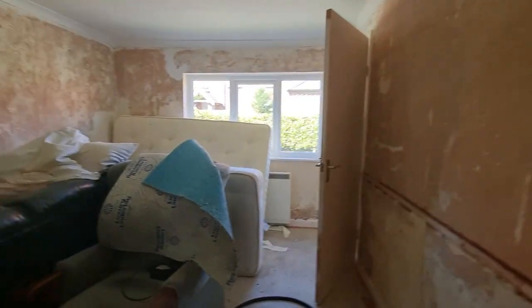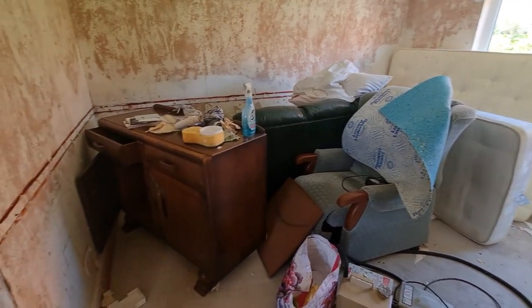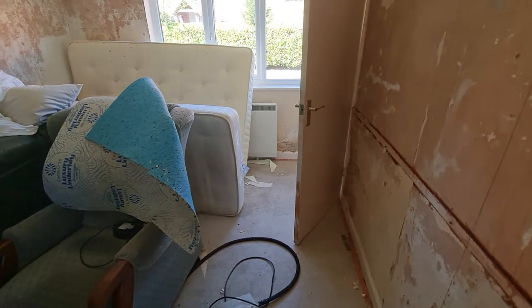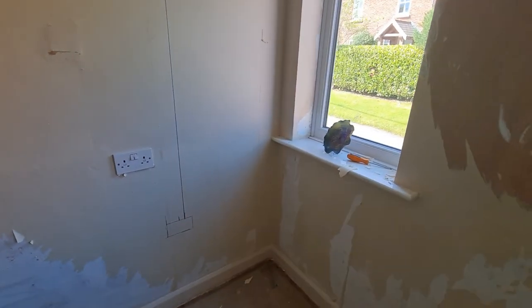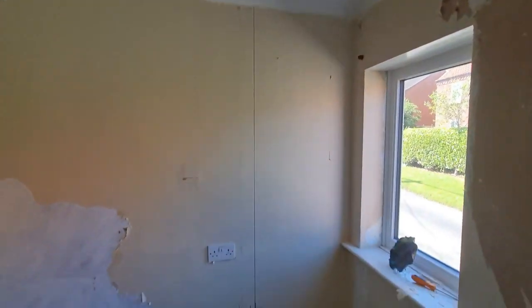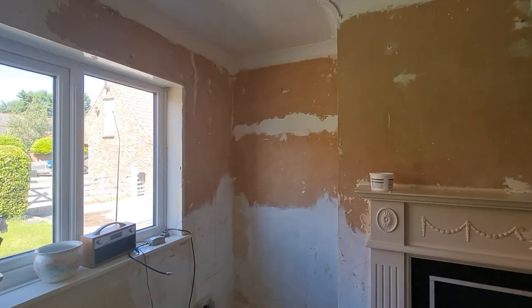Matthew's just done marking that up. This is the front room - there's quite a bit of furniture in here, all coming out before we start. There's actually a damp course treatment going on in this property, so the plaster is going to be taken off to a metre all the way around on the ground floor due to rising or penetrating damp, and a lack of central heating hasn't helped. We're going to get our socket points all chopped in in advance of that. The attic ceilings have been tested - no asbestos - so we're good. All of these walls are solid, no plasterboard anywhere, so plenty of chasing to get done. We've got chases in the corners for sockets.